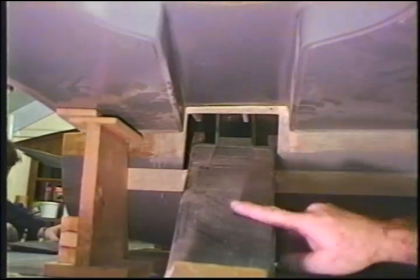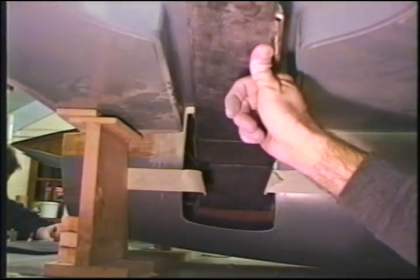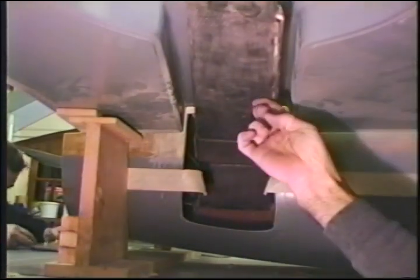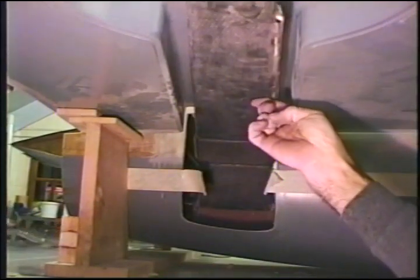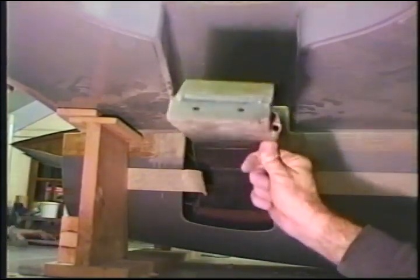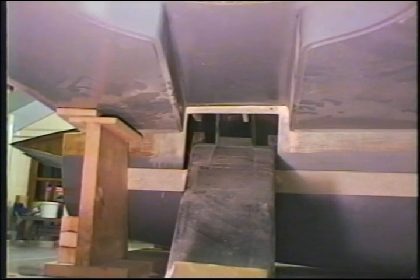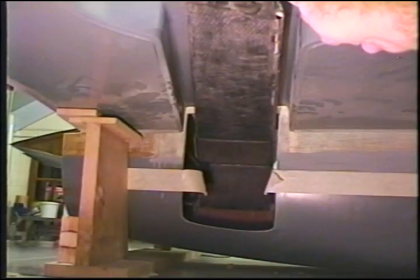If you were wondering why this gear's been sitting here all this time, and why I haven't talked about it, wonder not any further, because what I wanted to show you here was what this looks like and how your gear relates to the inside of this Strake, and as it should look. It's up inside the Strake. You have plenty of room for all of the things that you need to go in there. How it's supposed to work and how it's supposed to look. Minor discrepancies here from side to side. Fret not, it has no bearing on anything. The gear needs to be somewhat near the middle of the depression. It can be plus or minus 3/8 of an inch per side. No problem.